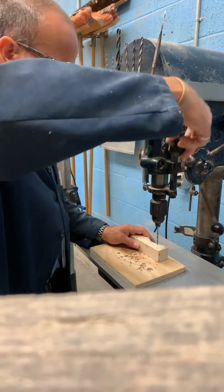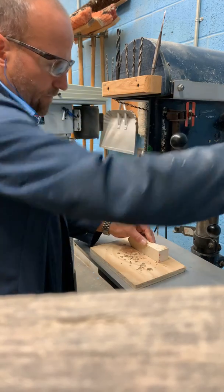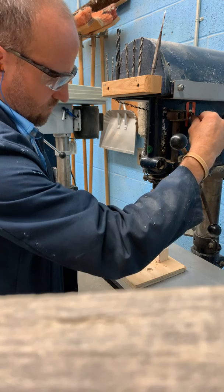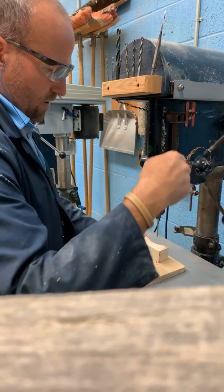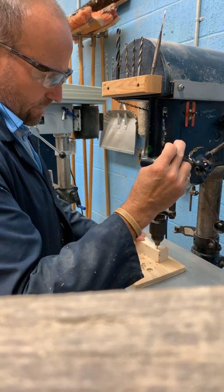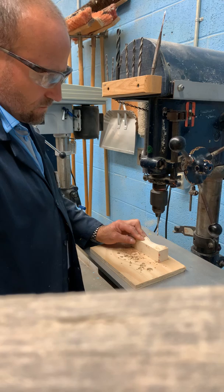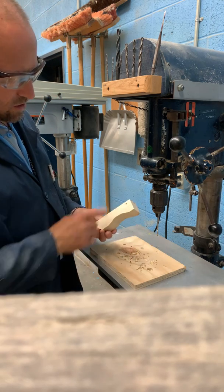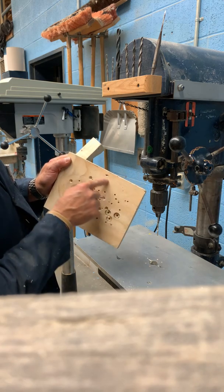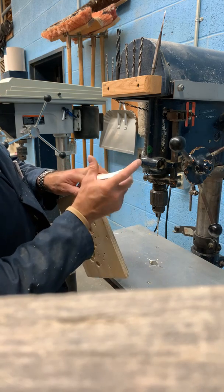We line that up so that our drill bit slides in there, then go back up. The on button is this orange button right over here — I just flick this toggle switch up. I'm going to make sure that I'm two inches away for eighth grade, four inches for seventh grade, and I'm going to drill my hole. I just line it up, the drill bit should find that hole, and I go nice and slow all the way through, then come back up while it's still on, and then shut it off. Clear the scrap, and I should have a nice clean hole on both sides. Make sure you were in a clean area when you drilled — drilling over big holes would cause the backside to blow out and splinter.